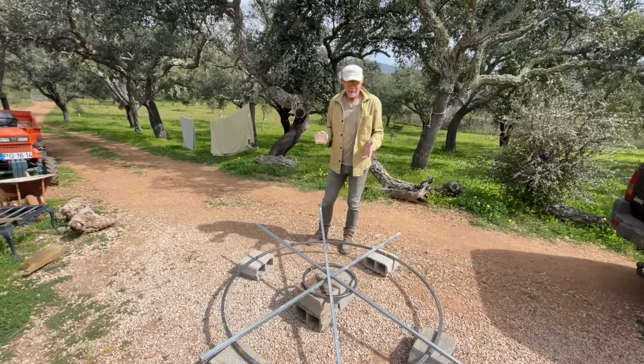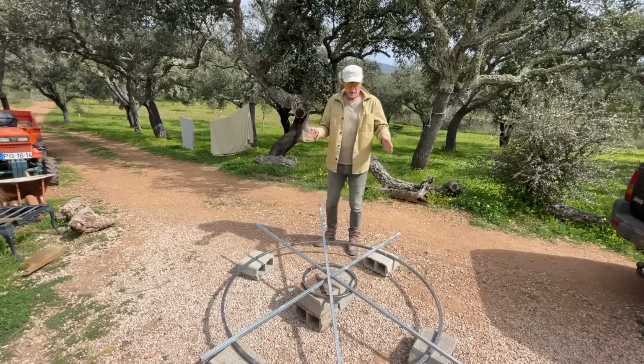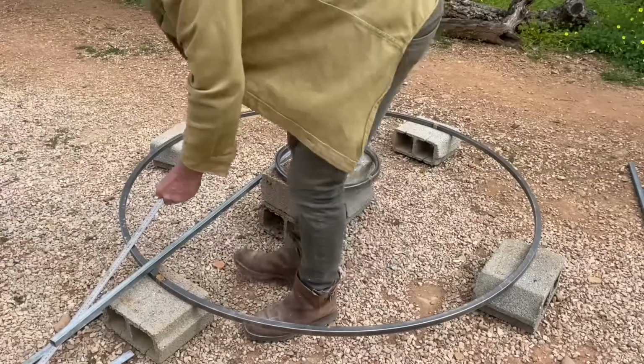My welding, and well, if it's flat and I don't do a good job of the welding, then it's not going to be very strong. Whereas if I have it slightly raised in the middle, I have a triangle shape, and then that will add a little bit of strength, pushing everything to the outer ring. That's the plan.